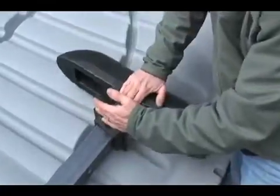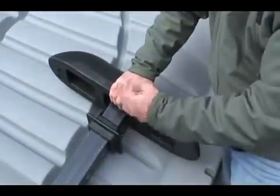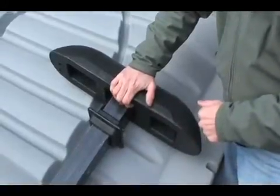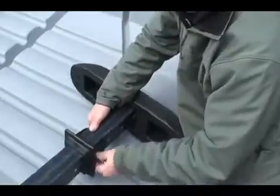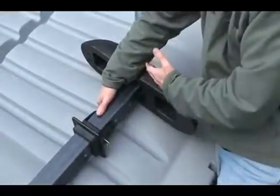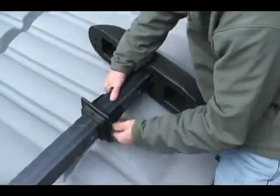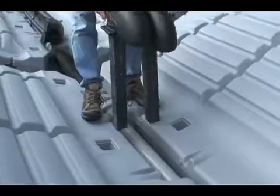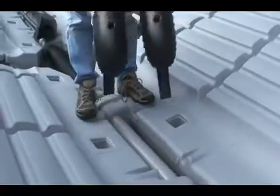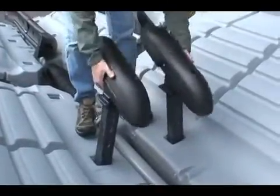The placement of the seat should be high, or with the bunk low, for a V-hull boat. It's better to start with it too low than too high. For an inboard, ski boat, or tournament boats, you'll want the bunk placed high enough to give enough clearance for the rudder and the propeller. The inner bunks will be placed in the center square holes, noting that the vents will angle down to the aft.